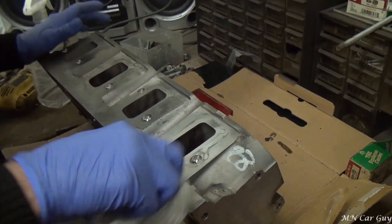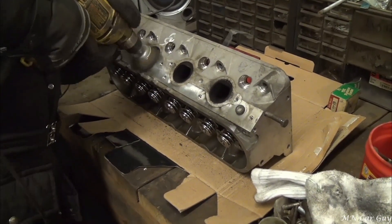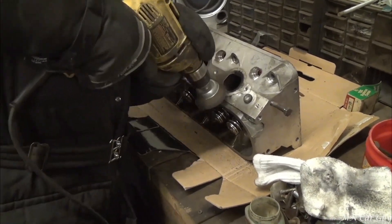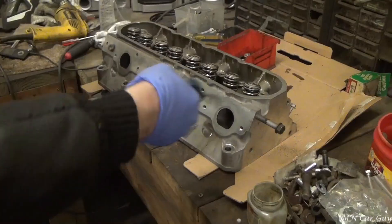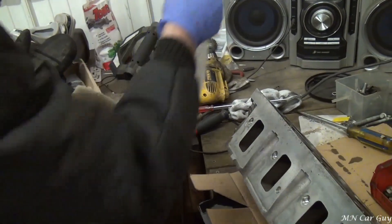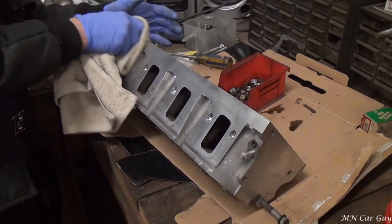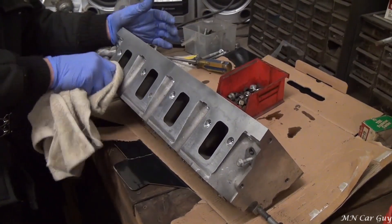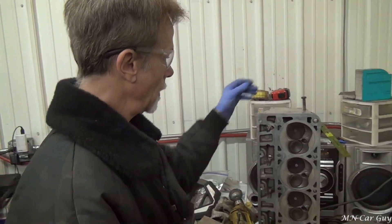This is a light solvent to help clear off some of the oil that's been left on here. I don't like spraying solvent directly onto the piece unless I'm going to immerse it — otherwise just spray it on the towel. A lot of guys use brake cleaner. I guess that could be okay on aluminum pieces. It evaporates rather quick. I myself have this lighter cleaning solvent — it's basically dry cleaning solvent.